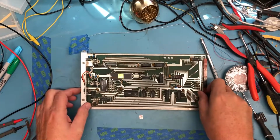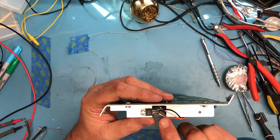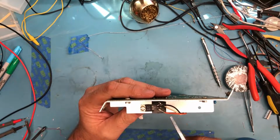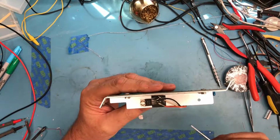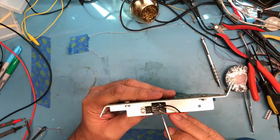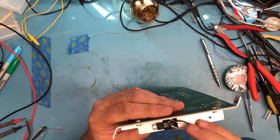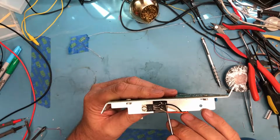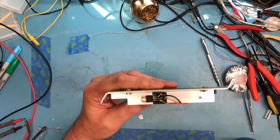So something I forgot to tackle during the 8080 card work, and hopefully this will show up on camera, is this mess right here. The 7805 originally had a 3-pin connector that slid onto the pins, and at some point they lost that connector or damaged it, and they've actually taken the wires with the little crimped on connectors that would slide over the pins, and they've soldered those little connectors directly to the pins on the regulator. I added this piece of electrical tape underneath when I noticed this, just as an added protection. But it wouldn't take much for these to move around and short.